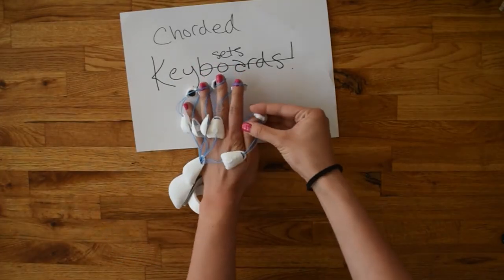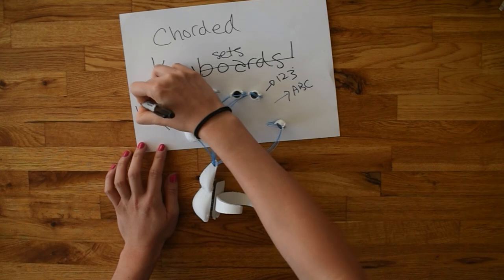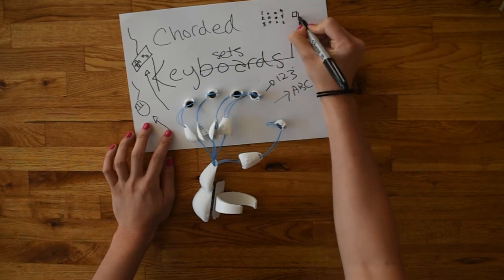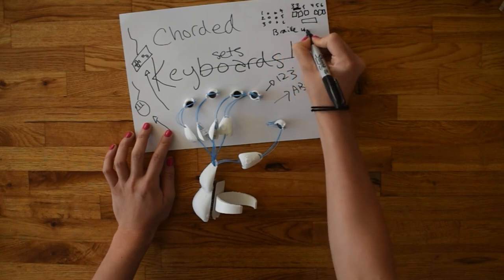This is a pretty basic prototype, and the code I wrote is very simple. Letters, numbers, backspace, and send. But Adafruit's BLE library allows for all kinds of commands and formats. You can imitate a keyboard, a mouse, or even a gamepad. I plan to eventually build a partial Sotto for my right hand that hooks up to the one on my left so I can use the same read-write methods but swap out the binary format for a Braille writer format.